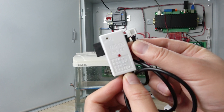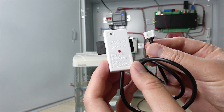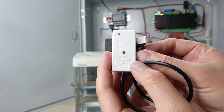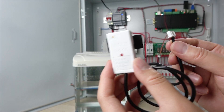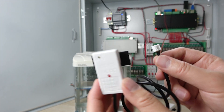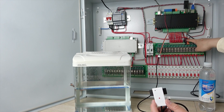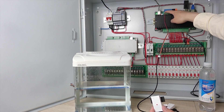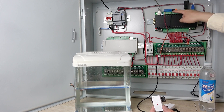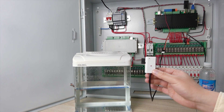The lines are: VCC and ground — that is 12 volt working voltage and ground. The output is common and dry contact output, so there is a relay inside. You connect this sensor to the server: 12 volt, ground, and also ground for the output signal, and the input signal. So there are four cables total.